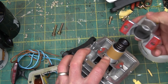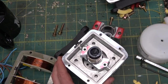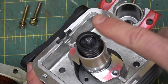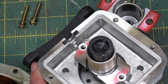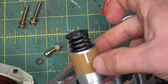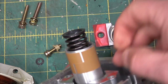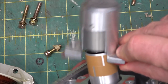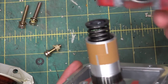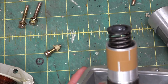There's the spring and the spring seat, and the little poppet. Here's the spring and spring seat. You'll recognize the grease — molybdenum disulfide, of course. We've got some Teflon labyrinth bearings here, just for airflow. I guess that would seal a little bit of air in there — that air would act to aid this spring, not only providing spring force but also damping.